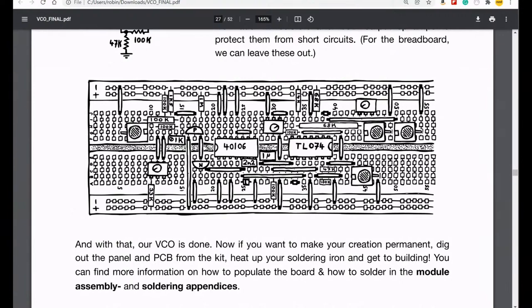It all got a little bit rearranged around here, which was quite heavy on one's mind, trying to interpret and still visualize where all the different bits were, because it had been built up over time. I felt like I compartmentalized it, so I knew that this bit here generated the pitch and the sawtooth wave, this bit here was the buffer, this bit here was the two transistors, this bit here was a square wave and the pulse width modulation, etc. So when those bits became a little bit mixed up, it did get a bit of a struggle.